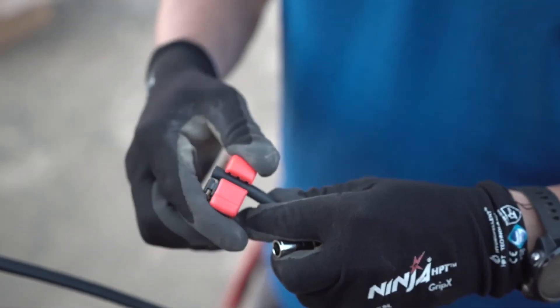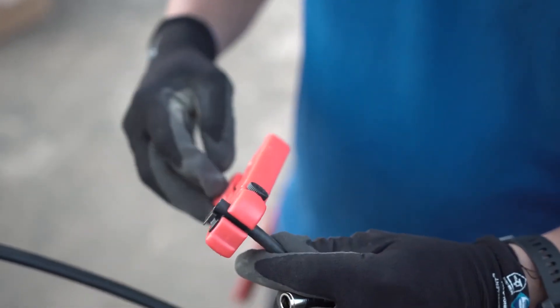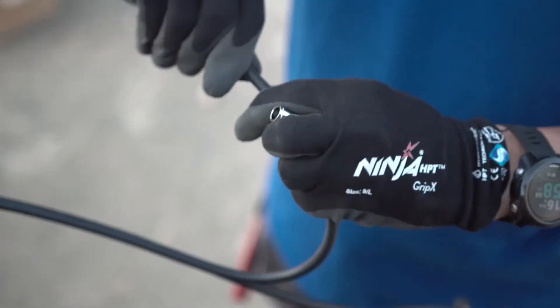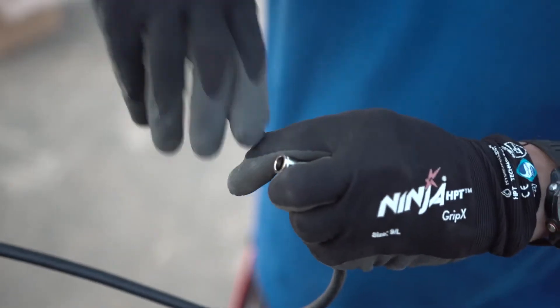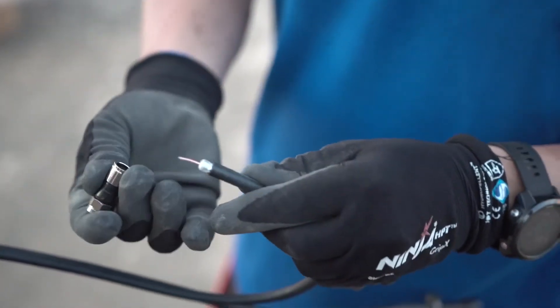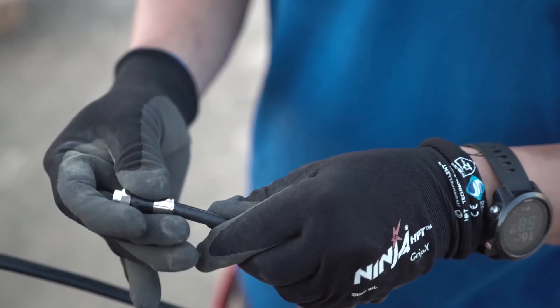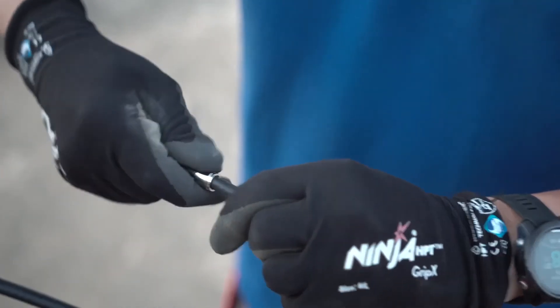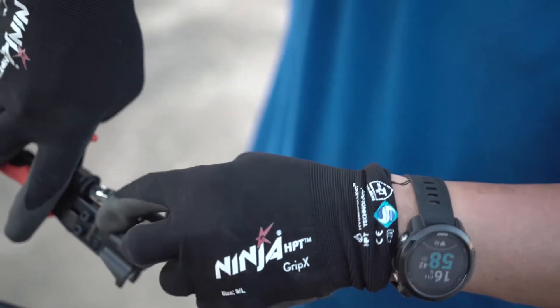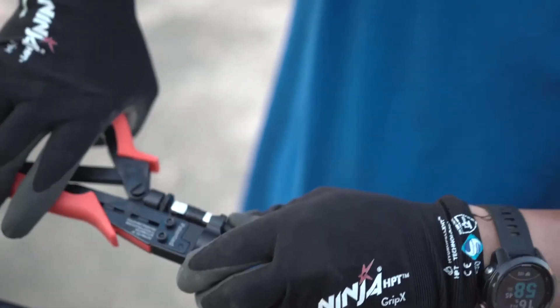This part is dedicated to the installation of the coaxial cable termination, which allows us to connect the transceiver to the modem. Clip the stripping tool around 1 cm from the cable end. To cut through the different layers of the cable, rotate the tool 12 times. Peel back the end to reveal the cable's metallic shield and the central core — make sure the core is straight. Insert the cable into the connector until it can go no further; for a better fit, give it a gentle turn. Once the connector is placed, use the compression tool to seal the connector with the cable.